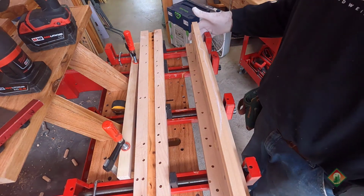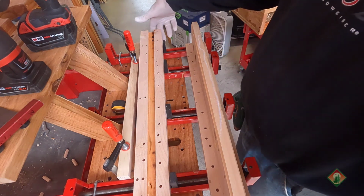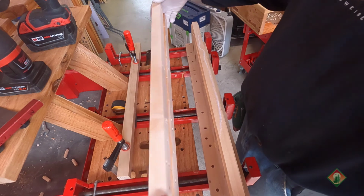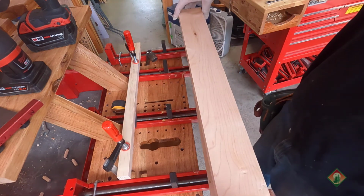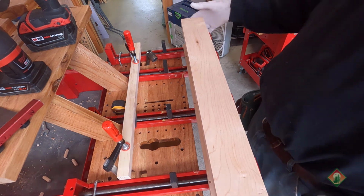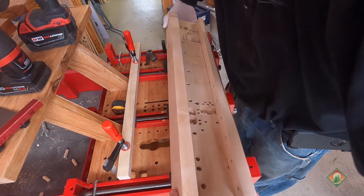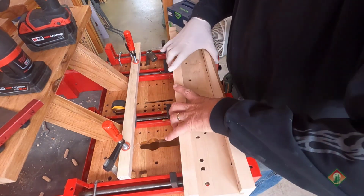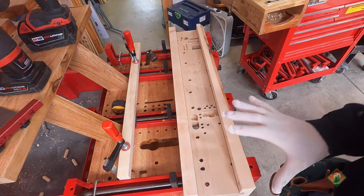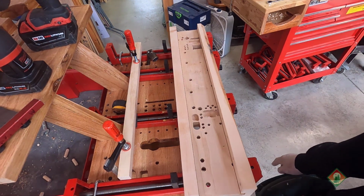And remember that glue is a lubricant. You may not think of that as a lubricant, but it is a lubricant when it's wet. So everything's going to slide around a lot more. So then I'm going to put that on there. And then I already set my clamps up, so then I can lay it down in there. There's plenty of set time on Gorilla Glue as well, so I can go get something else that I want to get. I'll be back in a minute.